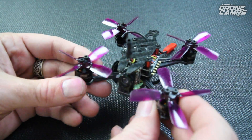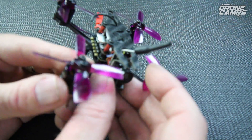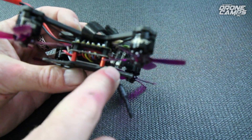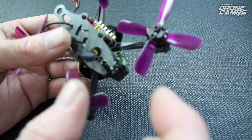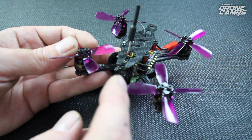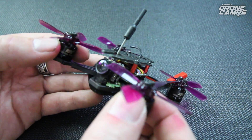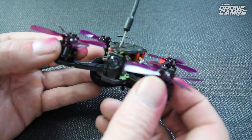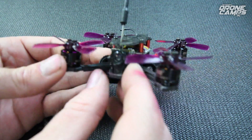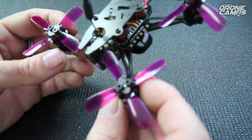It is a 25 milliwatt transmitter, but it has six different bands and 48 different channels, which you can change. There's a little button on the very top of this VTX camera — actually two buttons. One flips the screen and the other changes bands and channels. You can't change the power on this transmitter. If the camera shifts left or right, you're going to start hitting props. But this one seems to have better clearance than the original AR Fun, which I like, because on the original one the props would hit the camera.